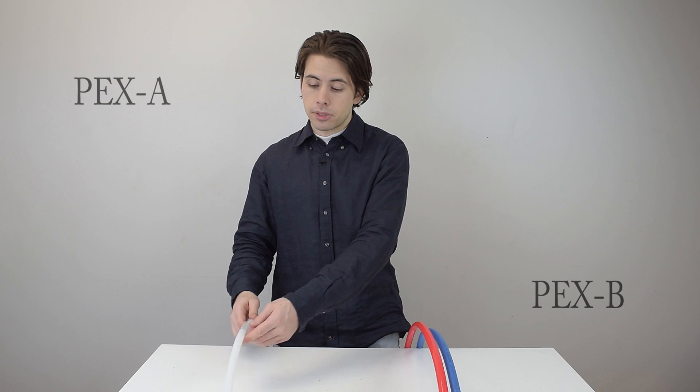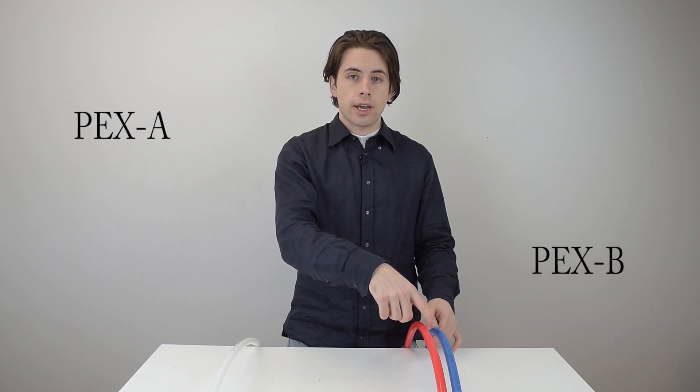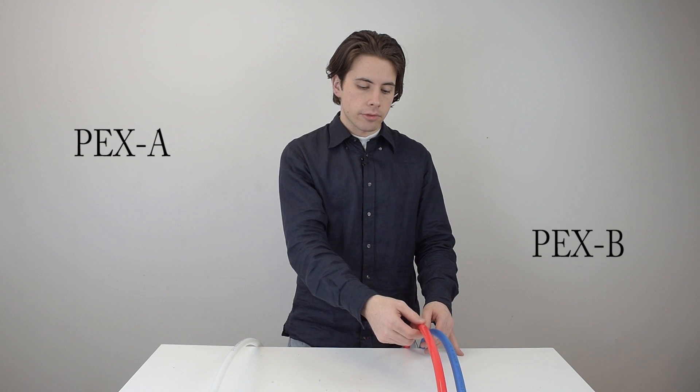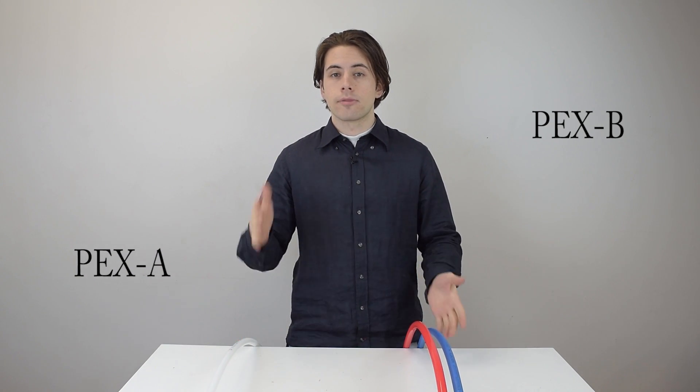What I have in front of me is PEX A and PEX B. This PEX A is from SuChief and over here is some PEX B from EverHot. The blue is your standard PEX tubing and this red tubing right here is radiant oxygen barrier tubing used for radiant heating systems that are closed-loop. I have another video you can click on the side that explains this in full detail, but in this video I want to basically break down the pros and cons of PEX A and B, where you can purchase these, who manufactures them, and so you're generally comfortable making your purchase.